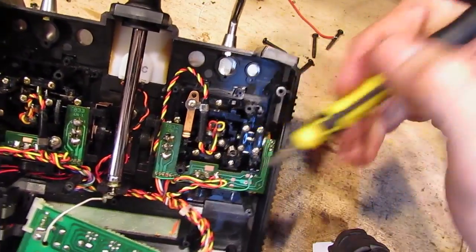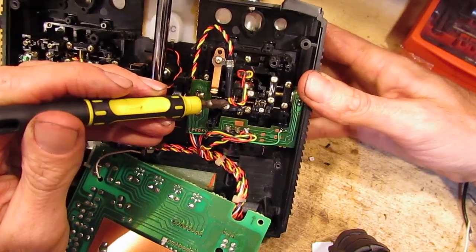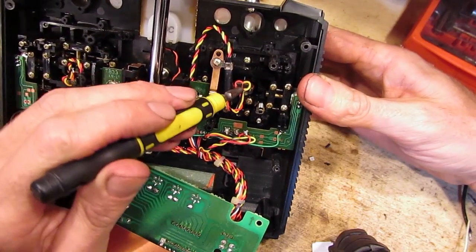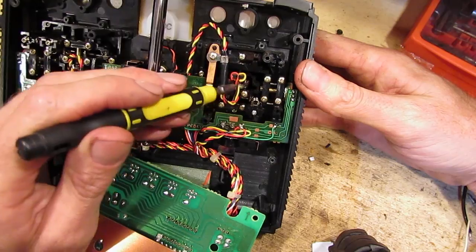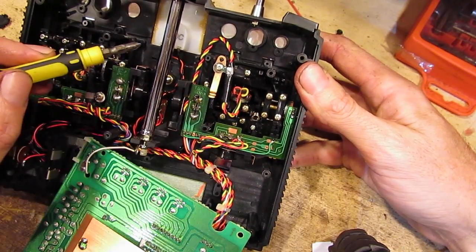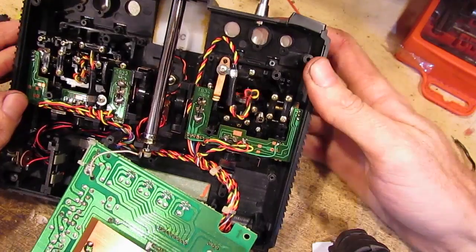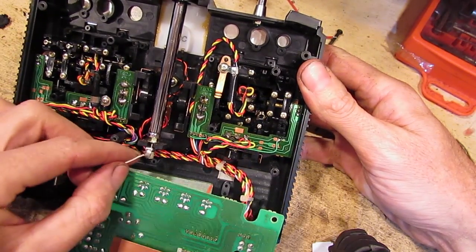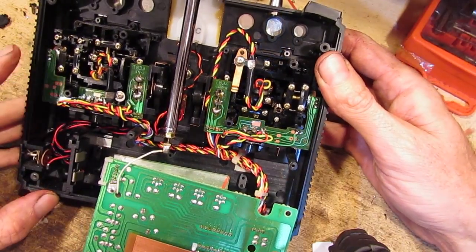There are no ball bearings in here but it is very, very well made. You can see there are only two wires that have to move, and they've protected them here with this big long rubber piece. They've wrapped them around and glued them to protect them, so all the flexing is spread out along quite a long section there. I have had to already replace some joins on my 9X that just wore out, more so because I was taking the radio apart lots of times. But this sort of thing is well designed. The antenna wire here is a bit dodgy — the screws come loose at the bottom — but other than that, it's very, very well designed.